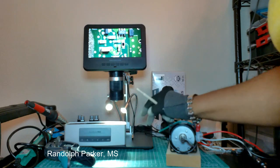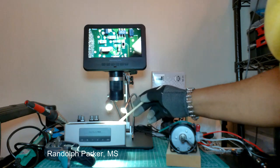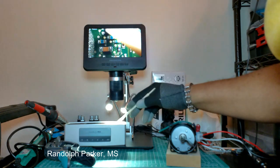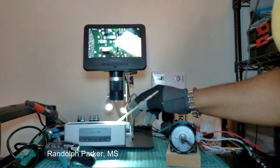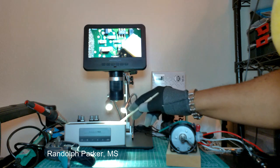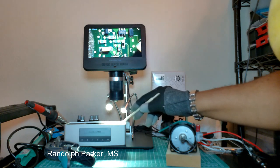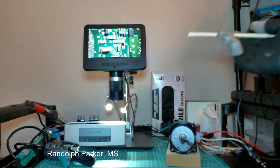So I'm looking for a schematic. I'm trying to source a schematic now in order to get the value, even having it on the microscope. As you can see, I can't even see the markers, but you can see the resistors and the other ICs and transistors next to it that you can see the markers really well, but there's no marker here. So most likely it is a jumper